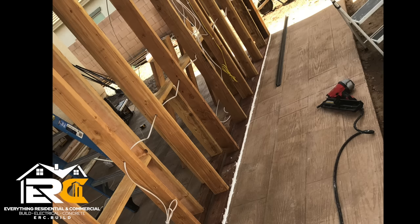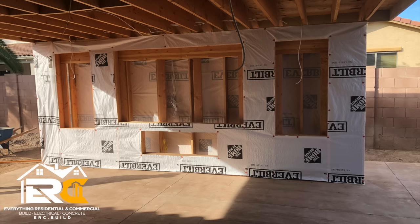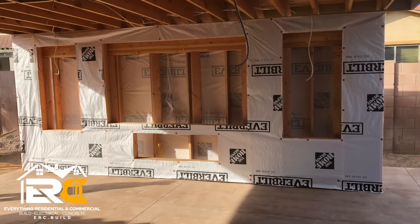This mud sill right here — we're using a pressure-treated plate and lots of quad sealant. We end up attaching a piece of L-flashing on the backside, then wrapping it with WRB — a weather-resistant barrier — which is like a big raincoat that protects you from rain and everything like that. You can see our wires in there.